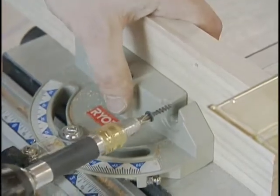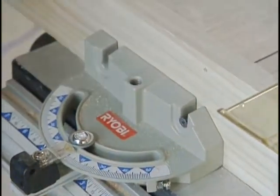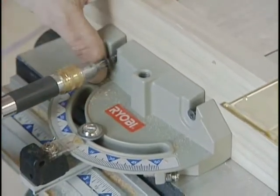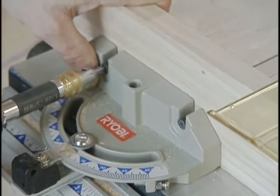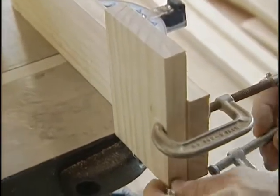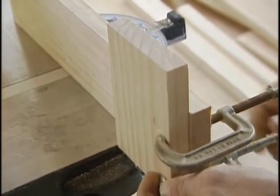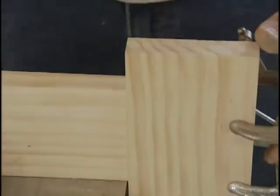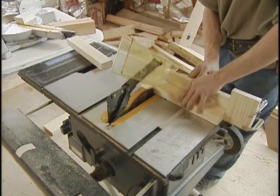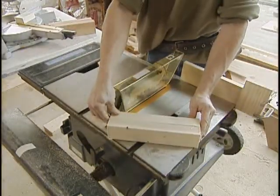You'll need to add two things to your miter gauge for best results. First, screw a wooden fence to the head of the gauge — this gives you a long edge that is more accurate when setting angles and provides more support when cross-cutting. Secondly, clamp a stop block to the fence so that once the block is in position, it keeps the board from moving sideways during the cut. Even minor movement will result in a cut that's not square. The block not only stops movement, but also assures that every cut you make against it will be exactly the same length.